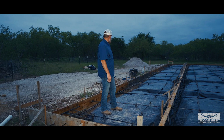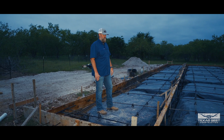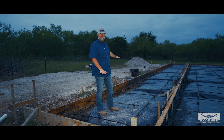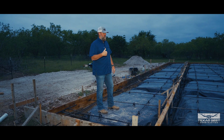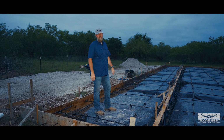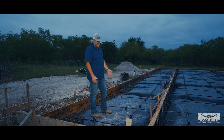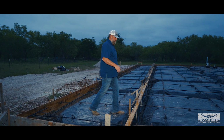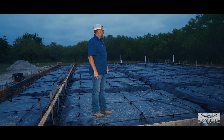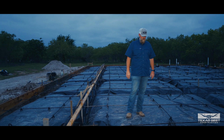And so you're gonna see all this get poured at one time. In certain situations, you may see fit to pour porches as like flat work. We could certainly probably do that in this case because it's not going to be a lot of weight supported. But when we send all this off for an engineered foundation, this is typically what happens. So it's all the more better, the more concrete you could put into it. So as you can see, we're not cutting any corners there.